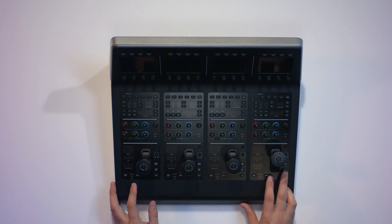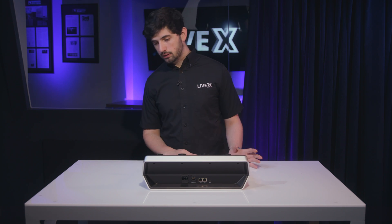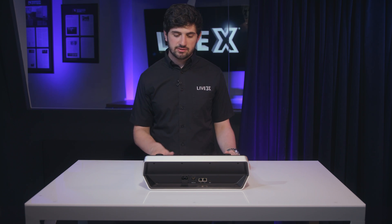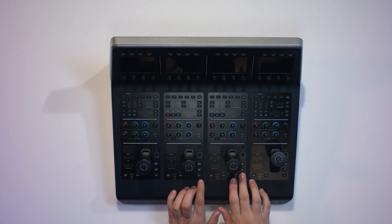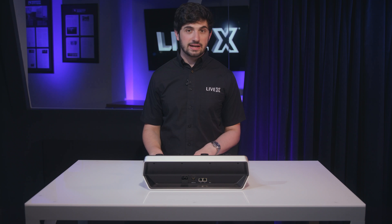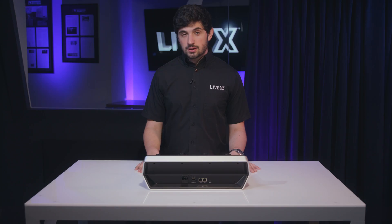There is the iris and master black activity level we talked about. You could just enable auto iris, so that'll go to the normal auto setting on the URSAs or MicroStudios. There's also a call button — I'd imagine you'd have to be plugged into the switcher for that, but it will give you direct access to communicate with the person operating that camera. You could put your whole workflow over one SDI line, which is really great.